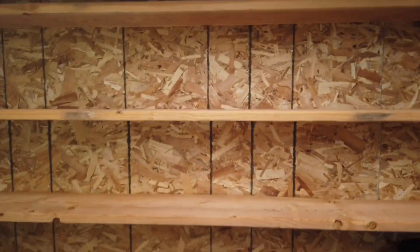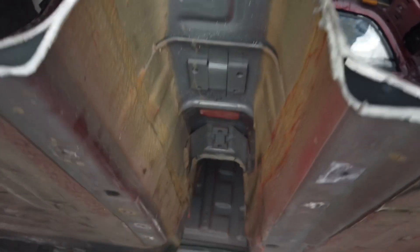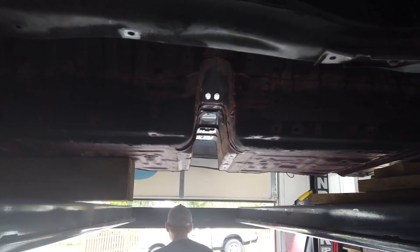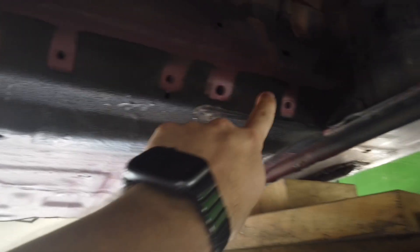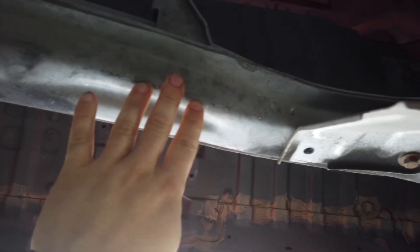My idea is that right here will be a tunnel - it's almost meant for it - where the tongue is going to be. I know there's some kind of mathematical equation to make the tongue long enough to get 10 to 15 percent of the trailer weight on the tongue weight. I'm going to take a big piece of aluminum square tubing from here and come back, then make another piece go across - so I'm going to make a T. I have bolt holes here already, so I might weld some ears on, drill those out, and put some bolts in. I might continue the first part of the T to make a cross and come right to this engine cradle, weld a flat piece of stock across, and use these bolt holes.